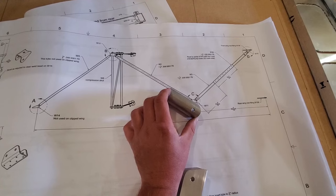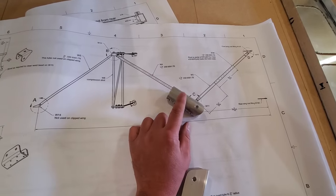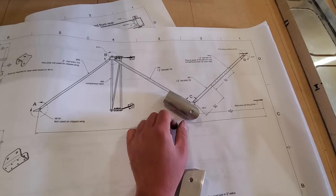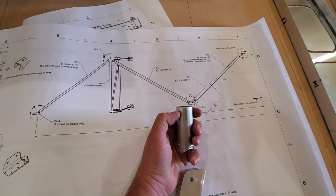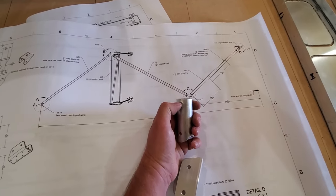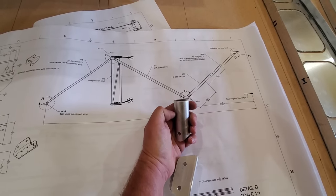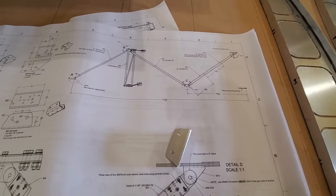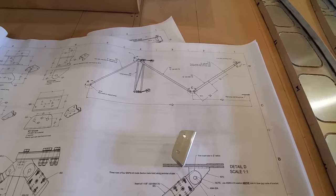After you drill it, you might notice we left this tube a little bit long on the inside. It is acceptable to pull it back out and trim it. We use on most of our parts the formula of two times diameter from the center of the hole to the edge — it is okay to trim it back to that point. Two times diameter from center of hole to edge of part is pretty typical unless otherwise noted.